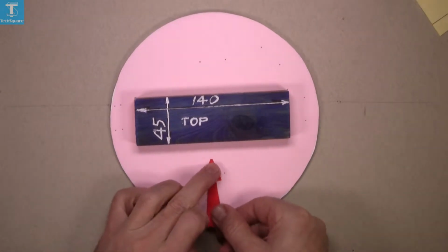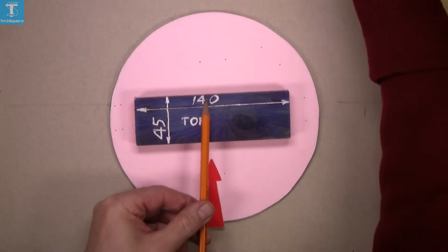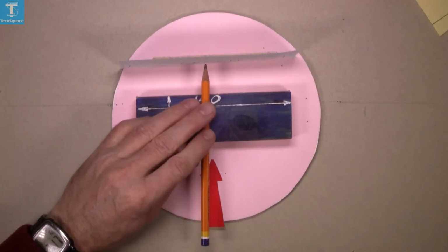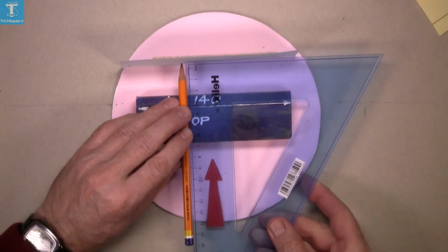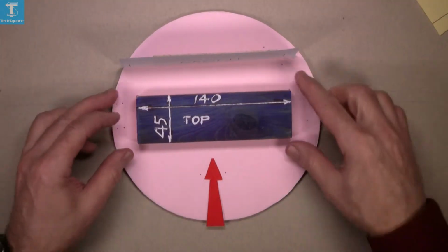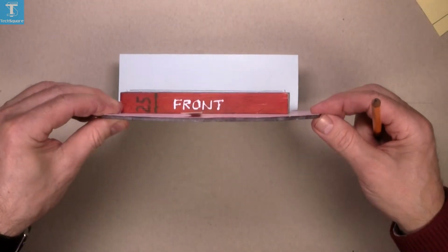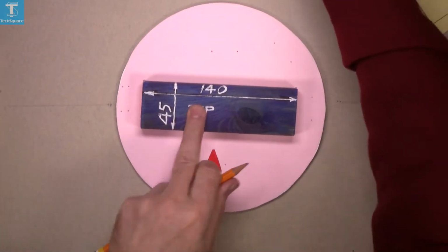When we view this from this direction, so looking at it from the front here, we have to put a plane at the back here that's at 90 degrees to the way we're looking at it. So when we're looking at it along that pencil there, the plane has to be fitted at 90 degrees to the way we're looking at it. The view we see now is we'll see the front transferred onto the new plane like that.